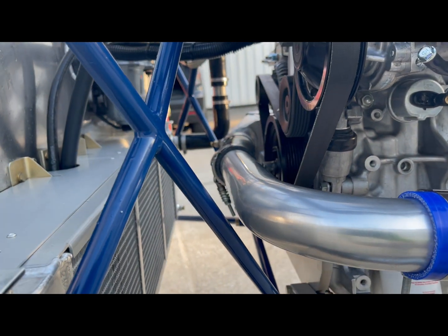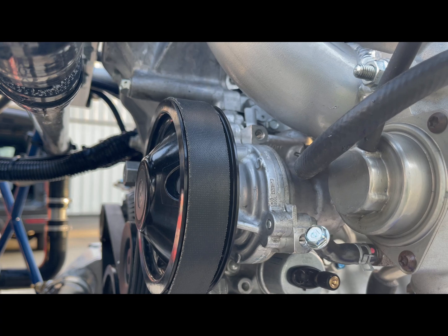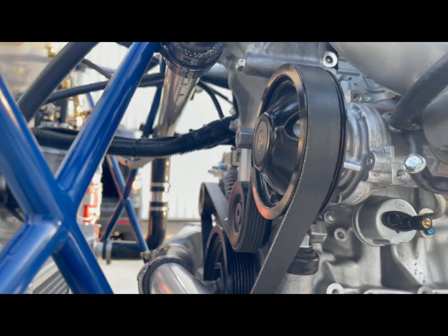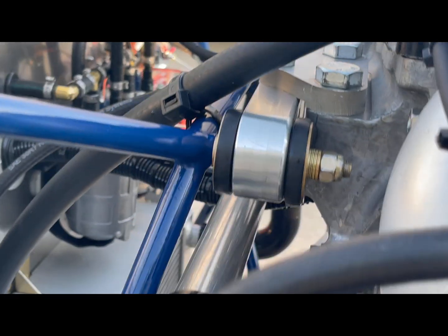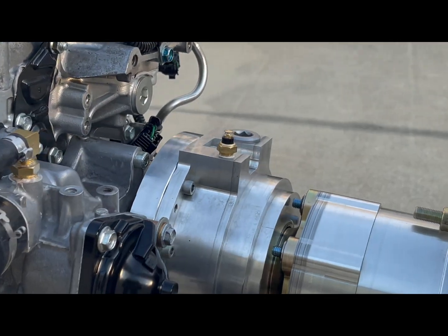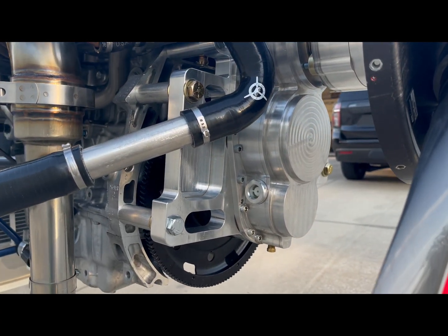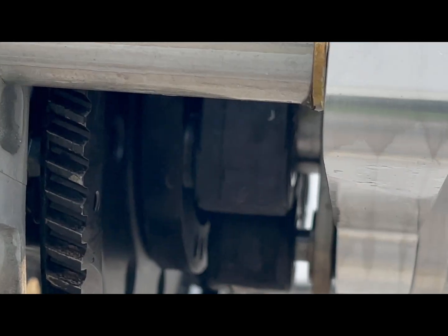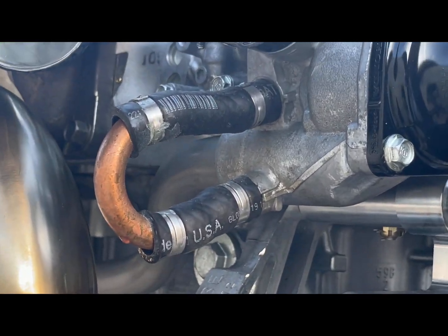Here's the high pressure side of the turbo with a pipe running across to the other side of the engine into the intercooler. Here we're looking at the coolant pump of the engine and the belt that drives the alternator on the other side. Engine mounts are on the bottom and top of the engine, left and right. Up front is the gearbox — it's the same as we use on all our engines, though it's a little heavier duty for the turbo engine. The back plate has a torsion-dampening rubber drive system behind it.